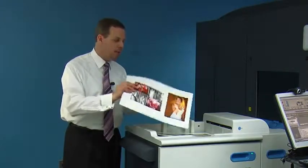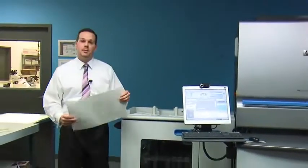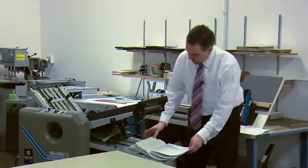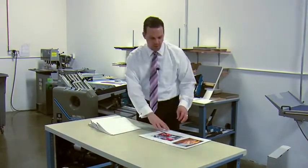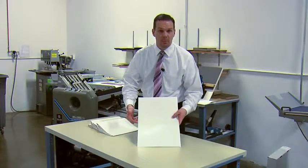The magic to the substrate is on the other side where the cohesive is. Once you've printed the job simplex and collated on press, you can walk the substrates over to your finishing department and start the assembly. We ran the panoramic paper through our folder collated. The interesting part about the panoramic paper on the cohesive side are fold marks indicating where the center of the sheet is. You can use this to help set up your folder.